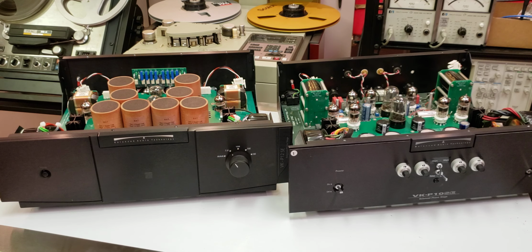And today we're going to concentrate on actually using that particular type of circuitry, the special head preamp for tape reproduction. How you connect it to your system and how you use it. There are some minor aspects to this, I don't want to call them major, but there are still things you should consider. Here again, we have two representative samples of similar topology, but done in different ways. One with simple toggle switches and front panel controls, and the other one with the front panel selector and a very, very short signal path configuration inside, just as we discussed last time.